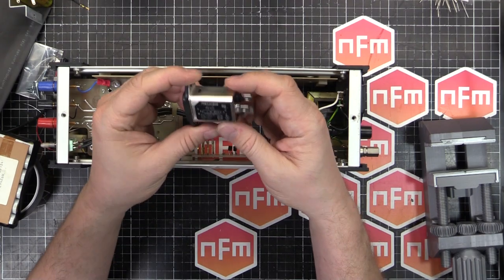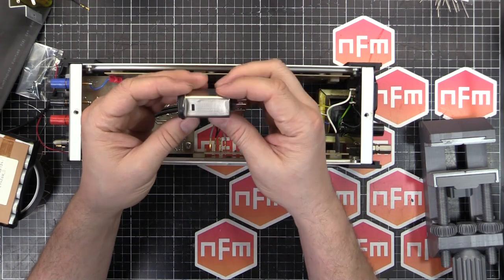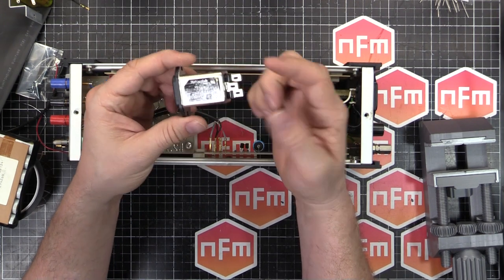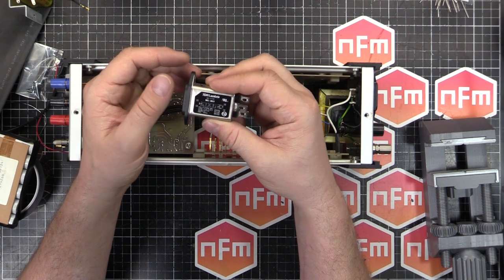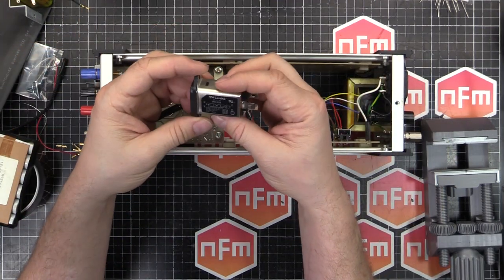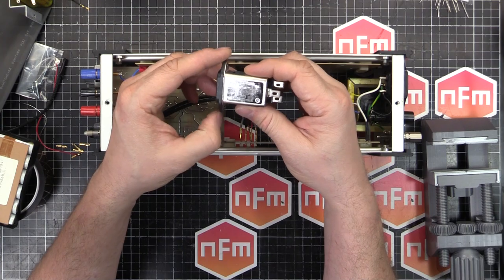Just be aware that if you buy one of these, check what the power draw of your device is, and don't get anything crazy big. Don't go, oh, I'll go for a 10 amp version because bigger is better. Not always. Often these things are a standard size, and if you go for a 10 amp version, the inductors inside have to have thicker wire to pass that higher current. That means they can only fit fewer windings on the bobbins inside, so you get less inductance. More current, thicker wire, fewer windings, less inductance. That means less filtering. What's the fuse rating here? At 115 volts, it's half an amp. I couldn't get a 1 amp version of one of these off the shelf, so I went for a 3 amp. If I went for the 10 amp version, it would be less inductance, less filtering. So size it appropriately. A little bit more than what you need is fine, but don't go crazy because you want as much filtering as possible.